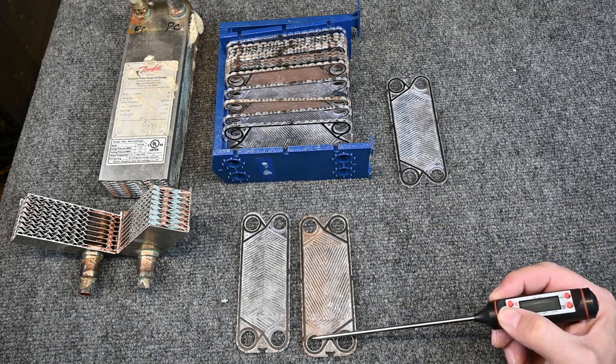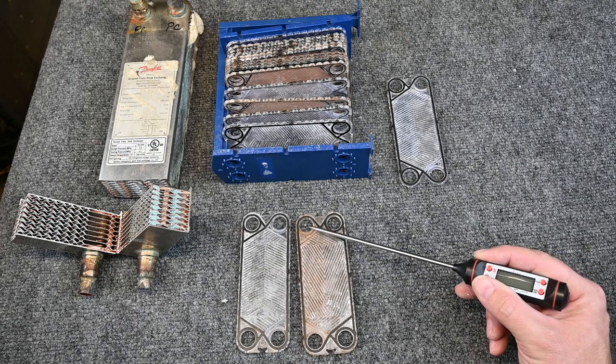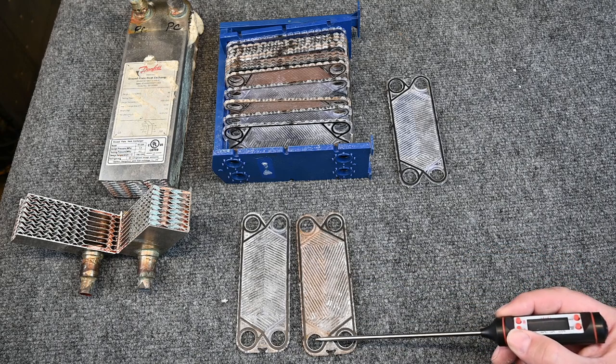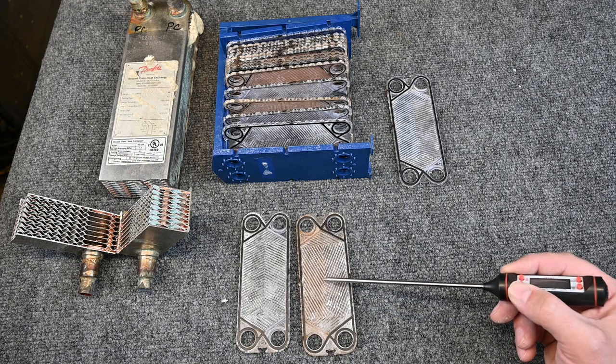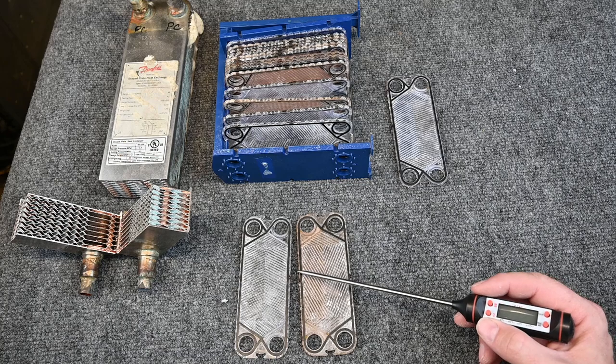But if you look on the other side, where this hole is connected, it's open to this plate and it can exit back on the other side. In our case, we're having refrigerant flow in and that refrigerant's evaporating, changing state from liquid to vapor and then coming back out the top. The very next plate we have is in the opposite direction.